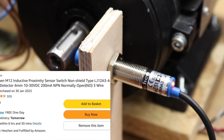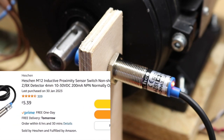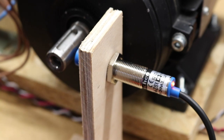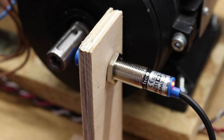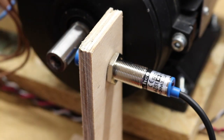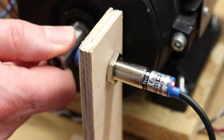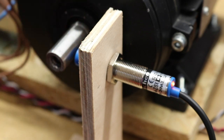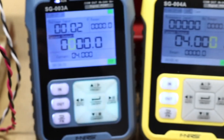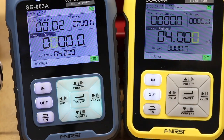You can see on the motor there's a keyway, and the inductive probe operates off that keyway. You can see the little light on the back - as I turn the shaft, the light goes out and comes back on again as the keyway moves past the sensor head. I'll just swing round onto the actual instruments.